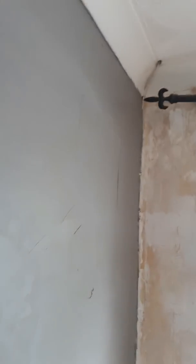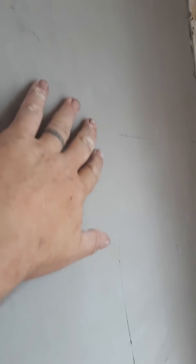Okay, so we've let this dry for about another 10 minutes. Now, if you stand opposite to wherever the light is coming in, you can see the shine across the wall, right? Now, if it's wet looking, like in your first coat, your second coat, it'll be wet and shiny. You can see now where the shine's going out of it a little bit. It's starting to get a little bit dull. It's not leaving the fingerprints as much, and if you run your hand across it, it feels a little bit dry. That's kind of where we want it now.